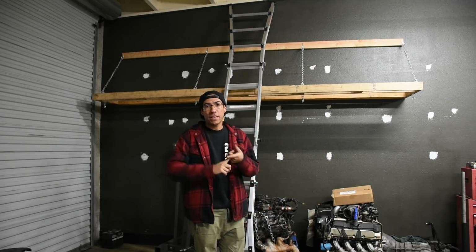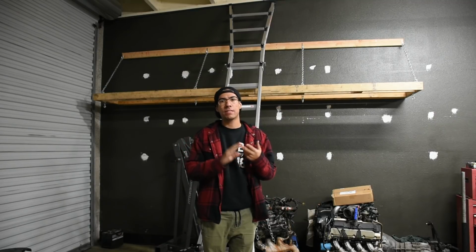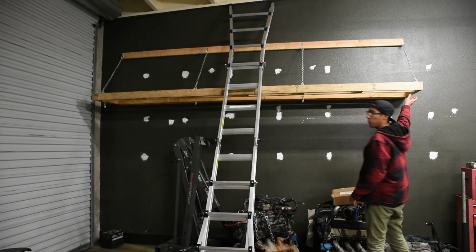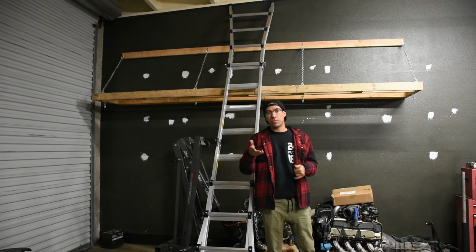So the main thing was, people said instead of using the wood screws on that top 2x4, to use lag bolts, I believe it was. A little bit longer, a lot beefier, and that'll hold it in better. Okay, another person suggested just putting a post right here in this corner, maybe one in the center, and then one down there straight to the ground to support it, which is a good idea.